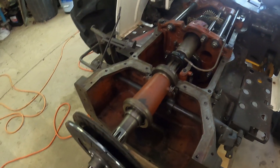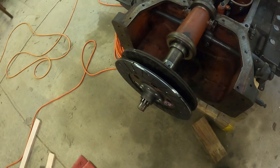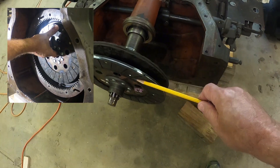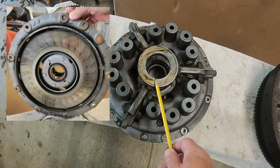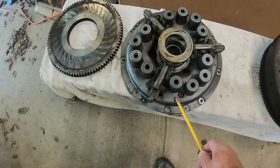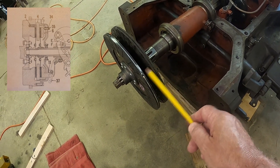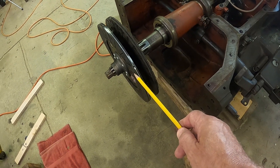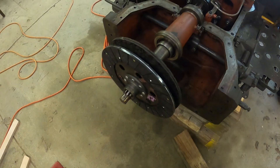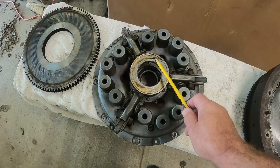The thing about the live drive clutch system is you've got two plates operating two shafts, so they are independent. You have your flywheel surface on here, the separator plate between the two, and then your cover or the pressure plate mounted to the back. This has springs in it that apply pressure to the plate inside, forcing all of this stuff together. So these friction pads are in contact with the separator plate, in contact with the flywheel surface, and in contact with the cover plate surface in the back.